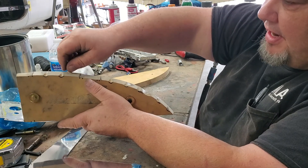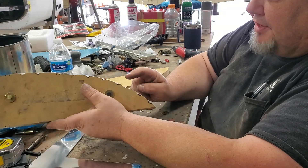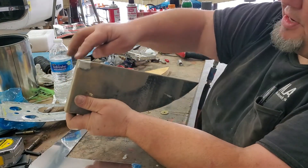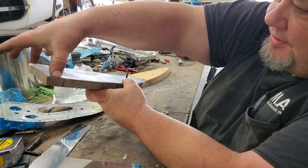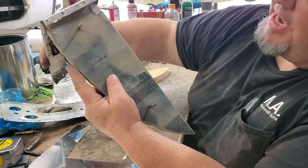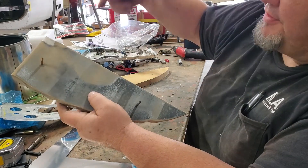I have a little kick shrinker that I can use to bump it ever so slightly to bring this whole edge nice and flat, and we'll adjust that as we go. There are a couple of joggles in here — one here, one in the center, one on the end, and one on the top — so there are actually four of them. There's a stringer here and then there's the longeron that fits right here, so it'll actually capture like this, with space for those lips or flanges to be, and then a rivet goes through all that.